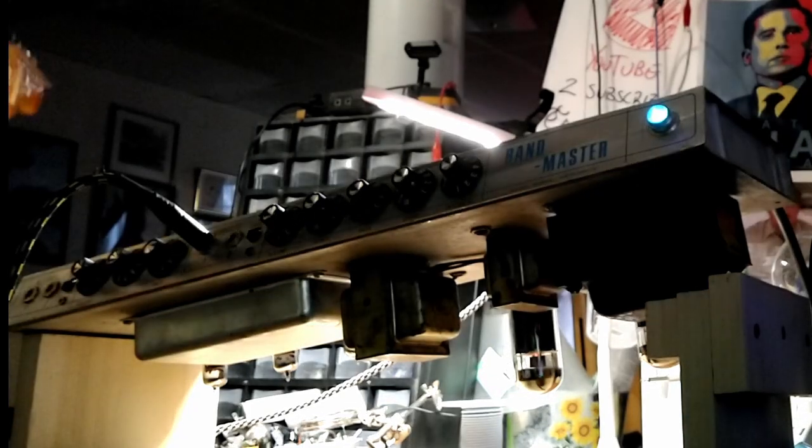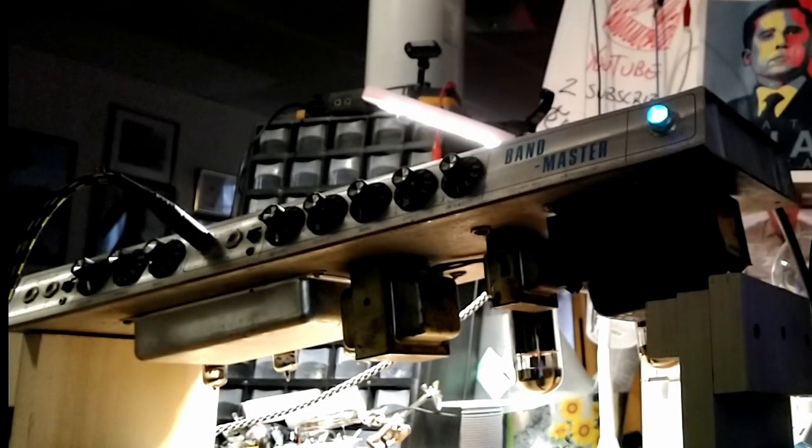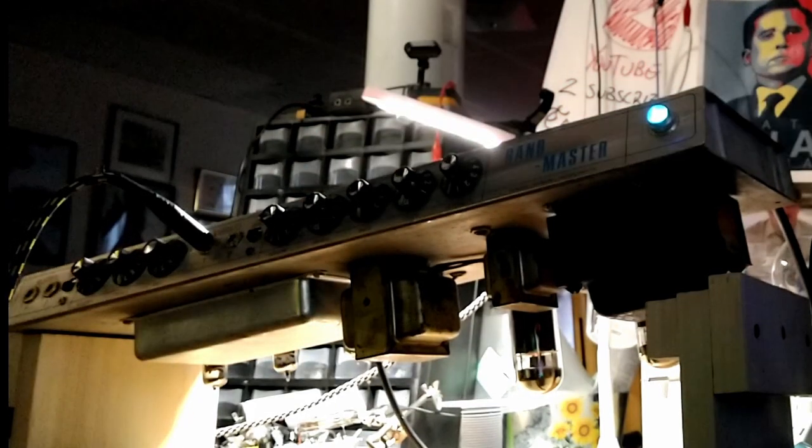Before, I replaced the RCA jack that the foot pedal normally uses with a grounding quarter-inch jack. So tremolo's always on, and if you want to defeat it, just any old quarter-inch jack will kill it. Like so. And there goes the noise, and it also shuts off the tremolo. So let's crank it. I'll demonstrate the negative feedback. This noise is caused by the proximity to my computer. This is with the normal, as designed, negative feedback in circuit.